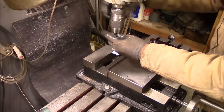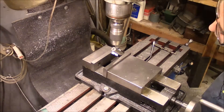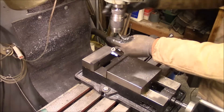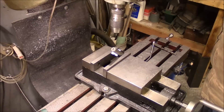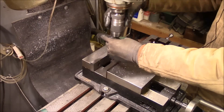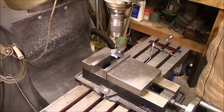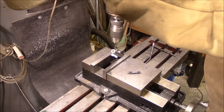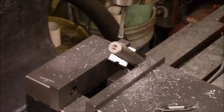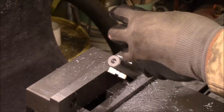Spot drill it. I'm going to use a little bit bigger one. Now I'm going to drill it out with a three sixteenths first. We'll change that bit out — we're using a letter T to fit our bit. It's just a little bit bigger than our bit.